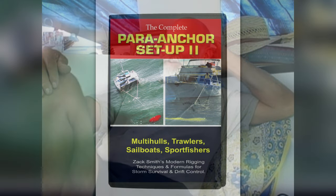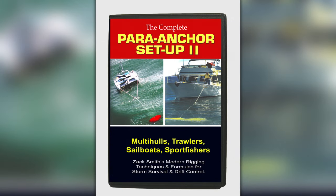We talked about it. We watched the video a couple times, and we watched the deployment and retrieval parts three or four times, because once I got it out there, I wanted to make sure we could get it back. So I went ahead and rigged it all up. We were hoved to — our boat heaves to very well with a double-reef main, no jib. We can point it into the wind and it'll sit there pretty good. But the winds were getting up into the high 40s, and I don't know how long the boat will stay hoved to. I figured if we went to sleep and she took off sailing, we'd be going pretty fast, pretty quick, and that kind of scared me. So that was another reason we decided to deploy the para-anchor.